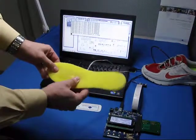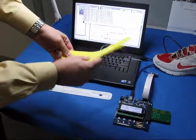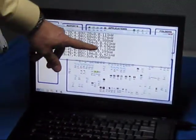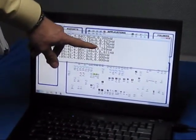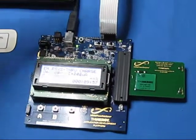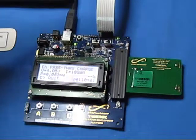This bent or flexed, as it would be inside a shoe, will produce a certain amount of peak energy. As you can see on the data log up here, it will produce peaks in excess of one milliwatt and probably continuous energy somewhere around a few hundred microwatts. You can see the energy harvesting that is being recorded and data logged here on the screen by our ADP kit.